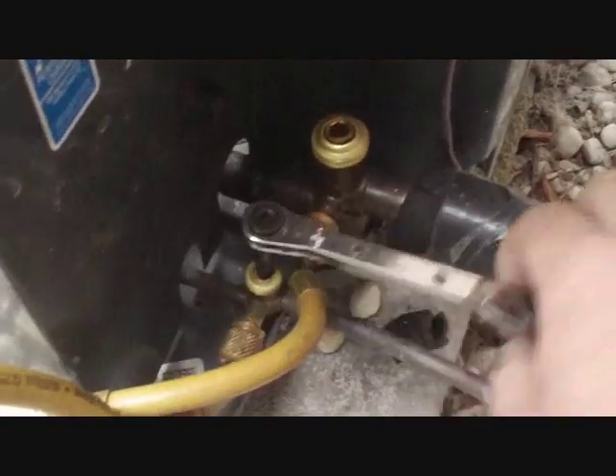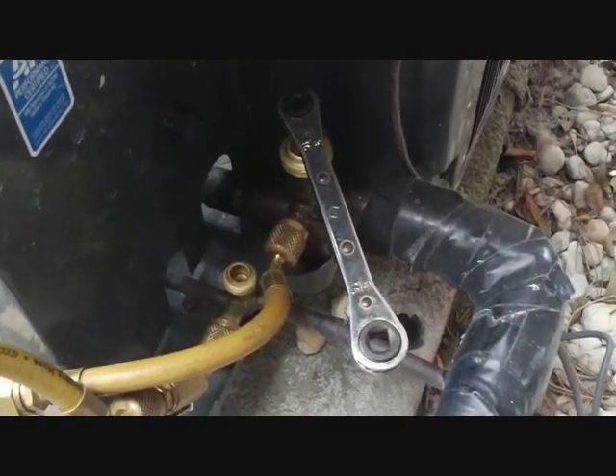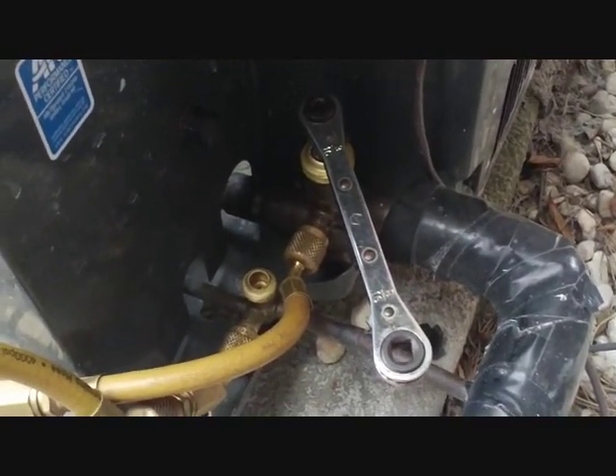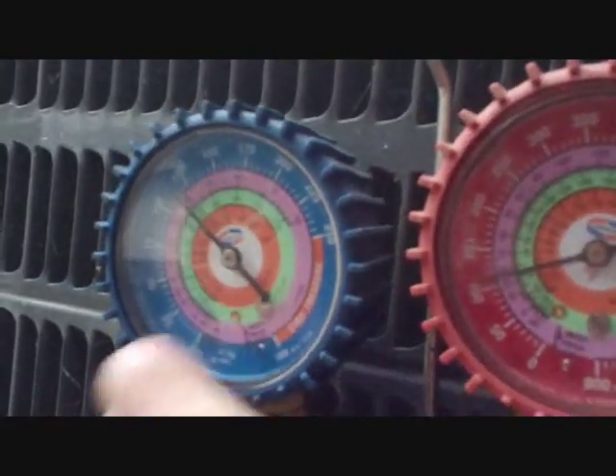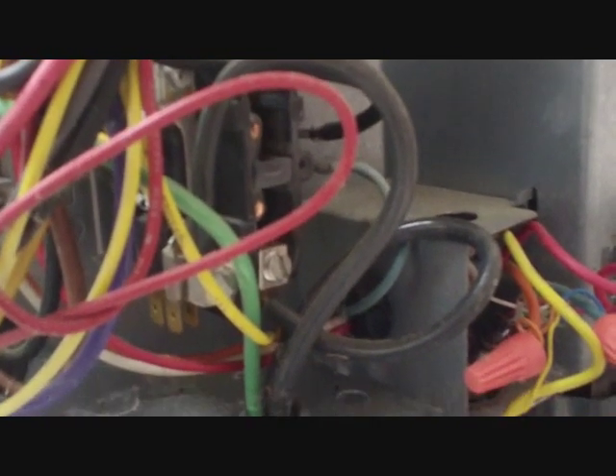The next step is to take your liquid service valve and shut it all the way off, because you want to pump any remaining refrigerant out of the air conditioner in cooling — pump it into the outdoor coil and keep it there until the repair is over. I'll set the service valve wrench on the suction valve so when the unit is done pumping down, we'll notice the pressure dropping. Once it gets to zero, we can shut it off and release the contactor.